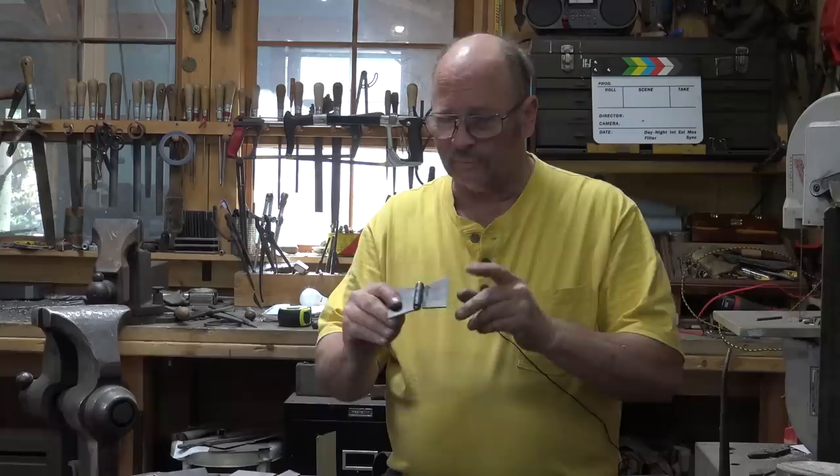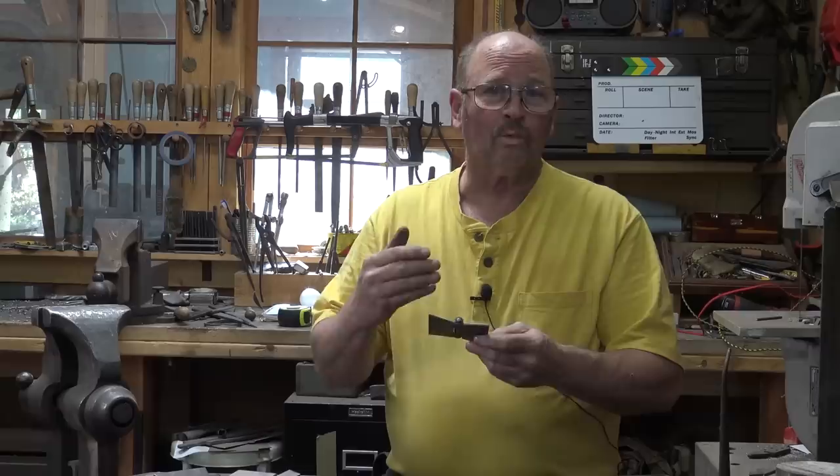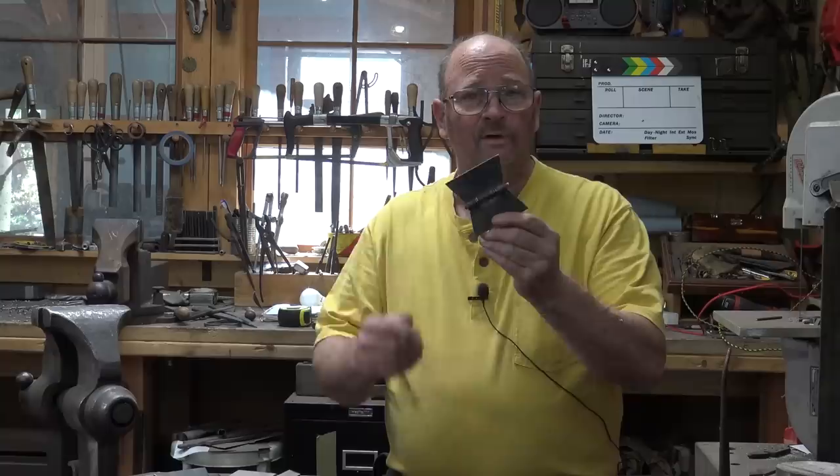And that's the case with these hinges done primarily under the fly press. You can create a perfectly workable hinge entirely cold. There's no hot work at all, just that little bit of cold forming under the fly press to shape the eye. Now, I won't leave them like that, because as a blacksmith, I gotta forge something. But I thought we would take a look at how to make these simple fly press shaped hinges.